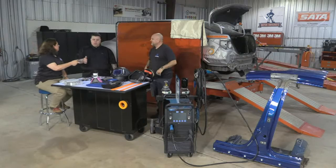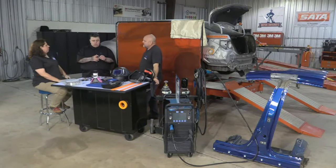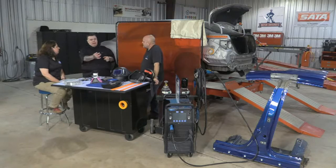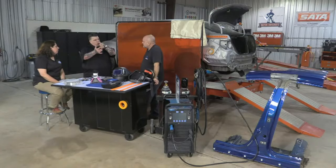As soon as I get the torch set, I used to just be able to turn away. You can't weld with one hand. You have to use two hands, because actually the dab technique doesn't work. Your trigger finger is not welding. My guide hand, the hand that I have on the torch handle, on the contact tip, in my glove, is what's actually directing the weld. This is just squeezing the trigger.